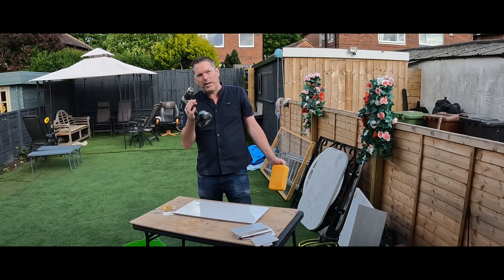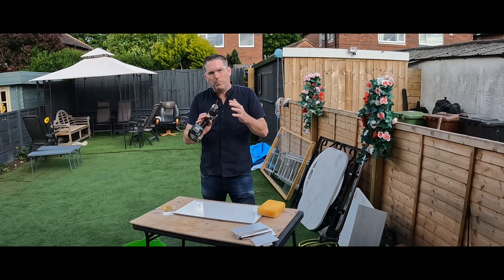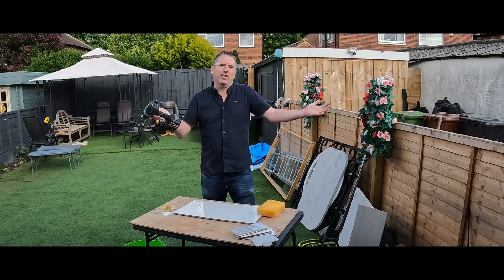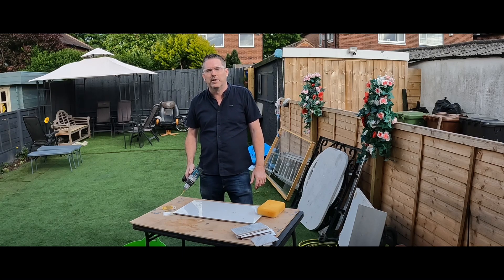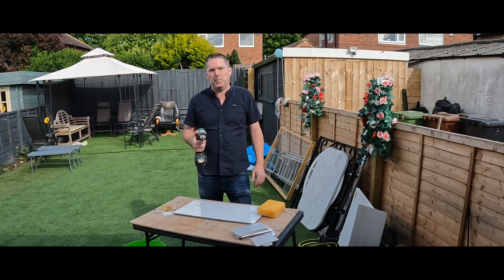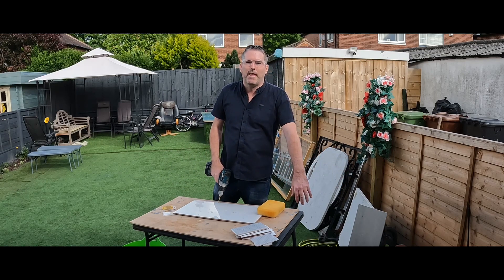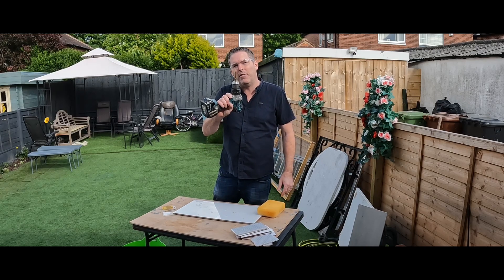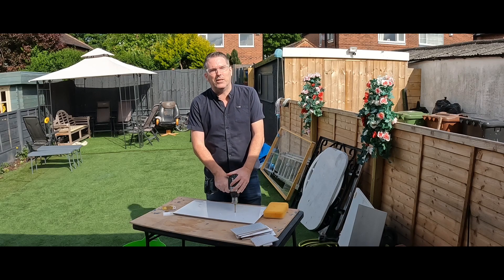Wiggle it, and with this you have to cool the bit down otherwise you'll snap the end off. You have two options: drill it really slow so it doesn't warm up too much, or keep it wet. That's why a pack of 10 for 15 quid makes sense — I normally go through about five packs. Once you've started, if you want the bit to last, keep it wet. Like dipping a wick — keep it lubricated and it'll always slide.